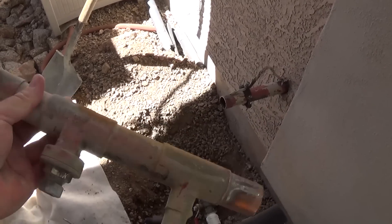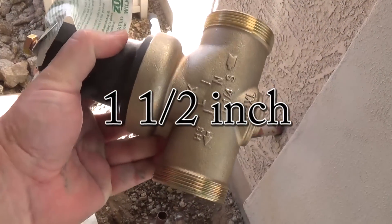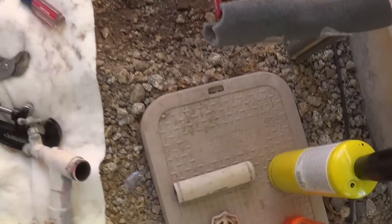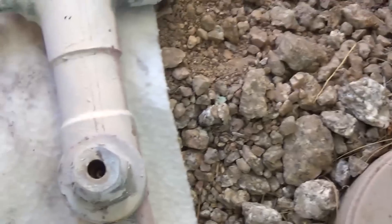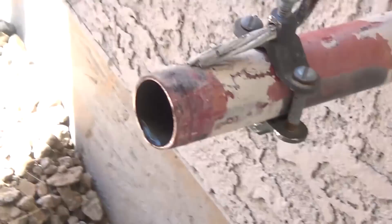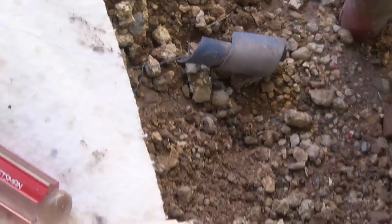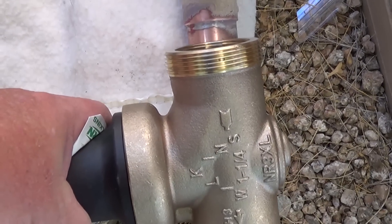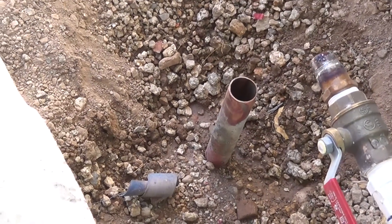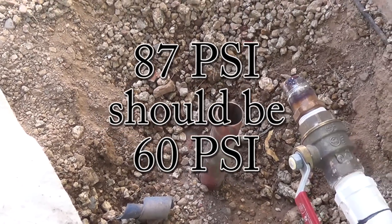So anyhow, we're doing a little bit of plumbing. We have a pressure problem and we're going to try to install this pressure reducing valve. In this process, we decided to also replace an old valve — there's the other end. We cut it at the house, cut it coming out of the ground — that one there goes to a sprinkler. We're going to replace this whole section right here, put it down here going the right way, and that will reduce our pressure. Pressure coming into the house is like 87 PSI, and as most of you know, the pressure needs to be below 60.